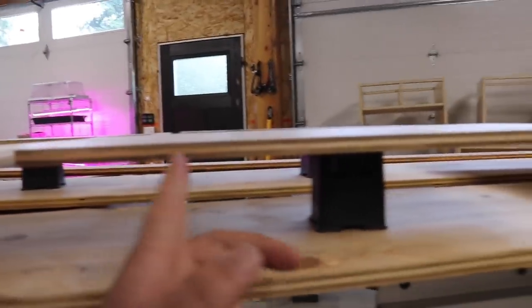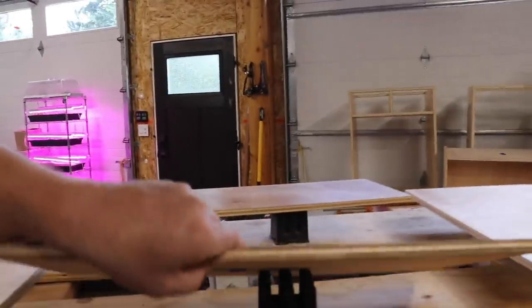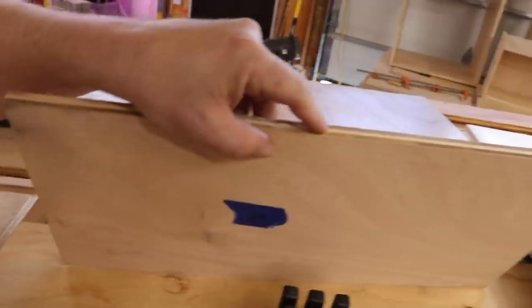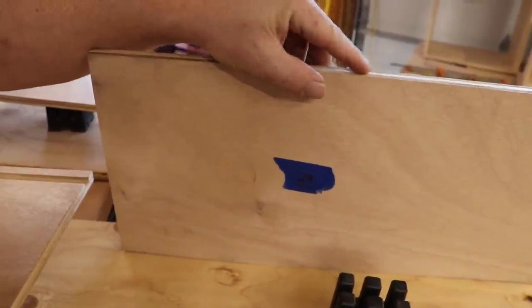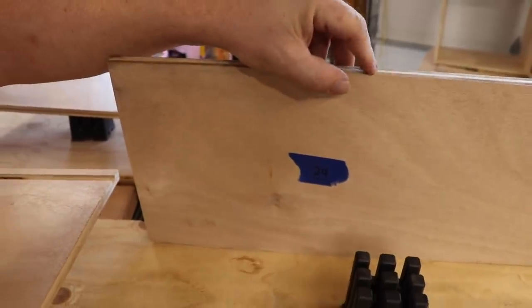I've been hitting the edge of this each time that I spray it. And I'll say it feels sealed to your finger. Like if you put water on that, it's not gonna soak in, but it doesn't look very sealed. But this is a semi-gloss, so I guess I'm scratching my head, and I don't know. I don't know if I wanna spend an entire day, not today, screwing around with finishes, playing with this sanding sealer and brushing lacquer on there versus spraying it.